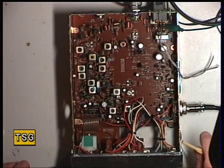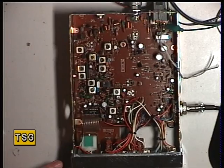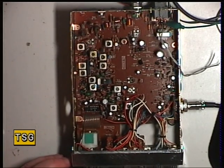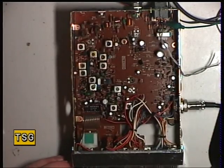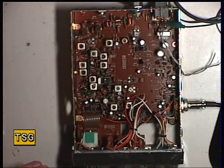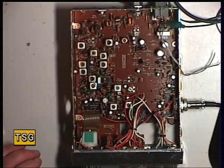So we'll now check on low power that we've got 0.4 of a watt. In fact, we've got exactly the same, so I'll just adjust that. The low power is variable resistor 4. 0.4 of a watt — that's fine. So we'll check that the meter reads 4 watts when we key up.